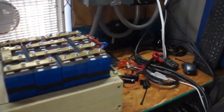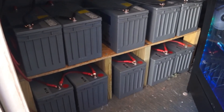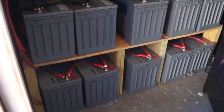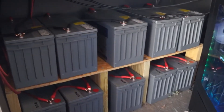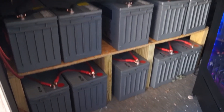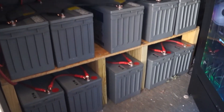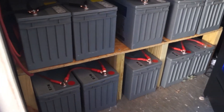I've got a network switch and a micro PC hooked up to the inverters so I can monitor everything. Down here I've got 105 amp-hour, 12-volt batteries wired in series for 24-volt output. On paper that's 500 amp hours, but it's more like 250 amp hours in actual use because SLA batteries are SLA. And my camera battery is dying — awesome.